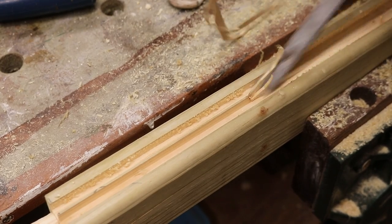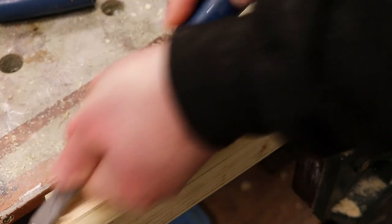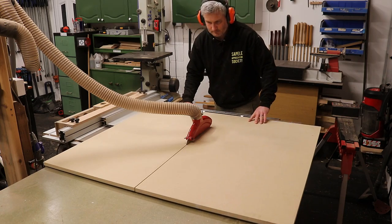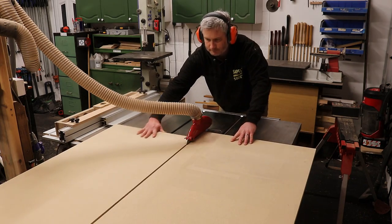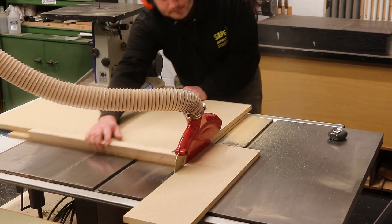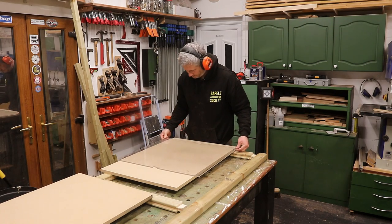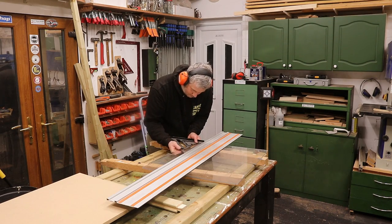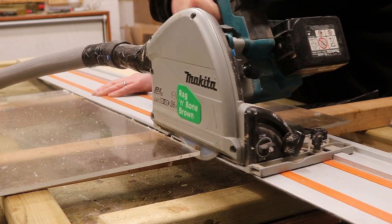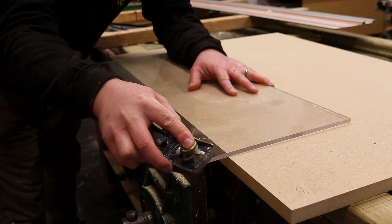This time I just used a chisel to remove the material in the middle as that was the quicker option. At this point I can measure the size for the panels, and I need to be careful to cut them so that they sit in the housing grooves but with a little bit of wiggle room so as not to make the glue-up impossible. So my dad mentioned that he'd quite like to have a window in the door to let in more light, and I have some 9mm plexiglass which I salvaged a while back from a library display stand. I'm going to use the track saw to cut this to size and then the block plane to remove the burr.